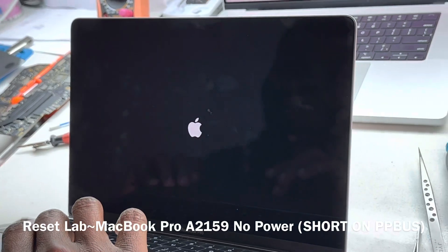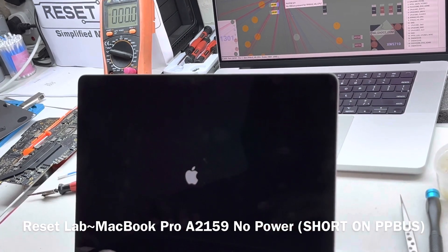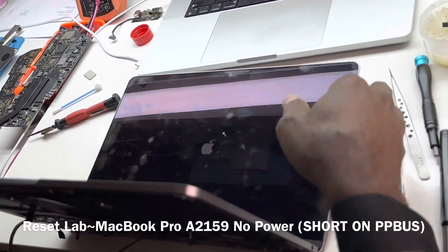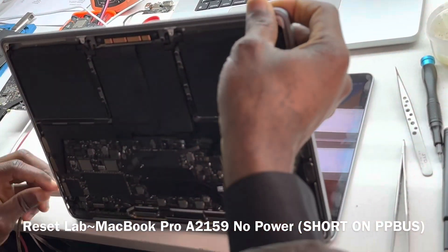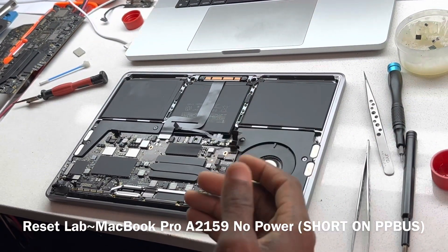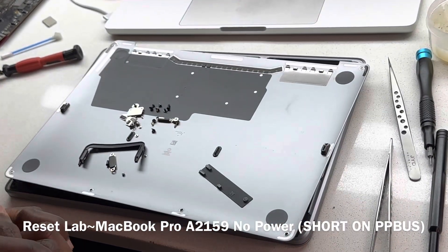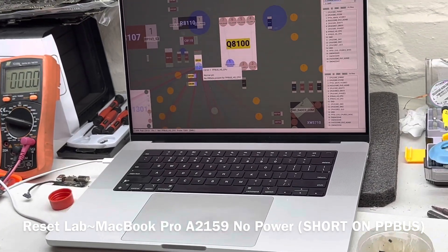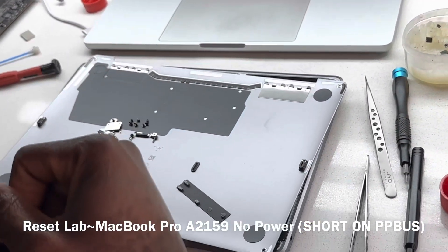Okay, this is good. We are not really going to be interested in waiting for the machine to boot to the desktop. This was a no power. We have a big queue to go over, so we will not have the time to do a full repair recap. But you guys saw what we did. The one cap that was affected was the C8101 — that was blown out and was creating a short on the PP bus line. We replaced that and we're good to go. Thank you guys. This is a complete repair. I will see you guys in the next one.